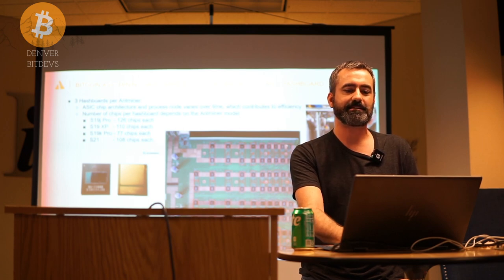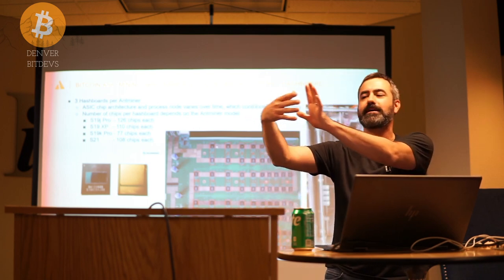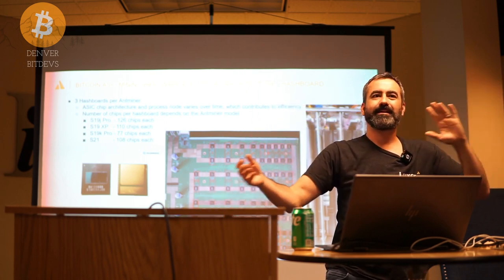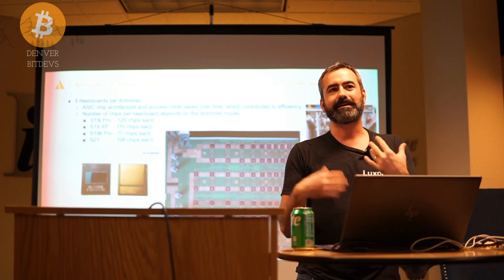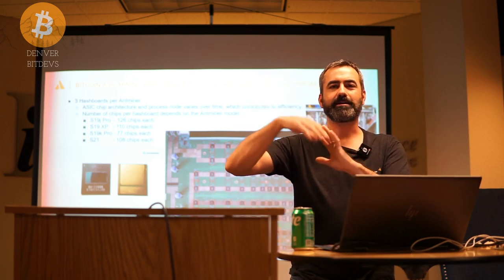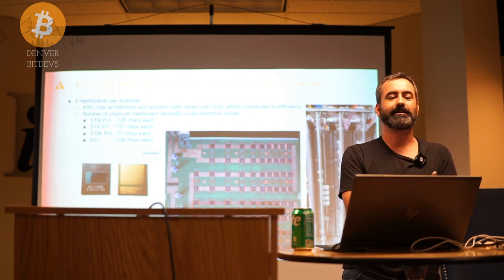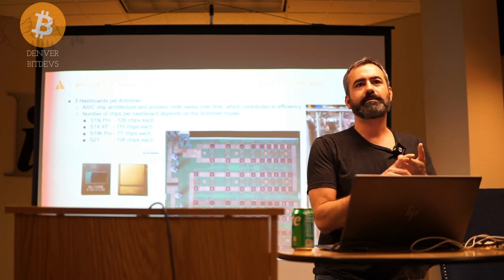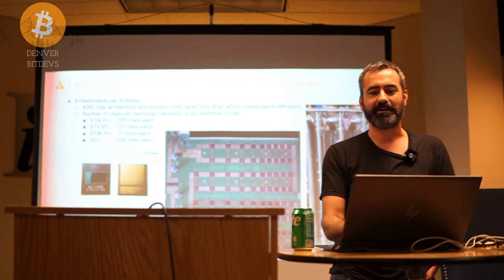It's pretty crazy. But yeah, this is all the ASIC chips. You can see how they're spaced here. They get closer together and farther apart. These close ones together are on the inlet side. The farther apart ones are on the outlet. So the idea is the air is going to heat up as it goes through. So there's really crazy mechanical engineering and thermal considerations. If there's an ME in the room that knows about this stuff and wants to present, that would be a cool presentation. I can talk through some of this, but it can go way beyond. Designing a miner, a huge part of that is how do we handle all this electricity that converts to heat and then dissipate it. And that's why we see hydro miners, immersion mining, all these other ways to get rid of the heat besides super loud fans that just annoy everybody, especially in your home.